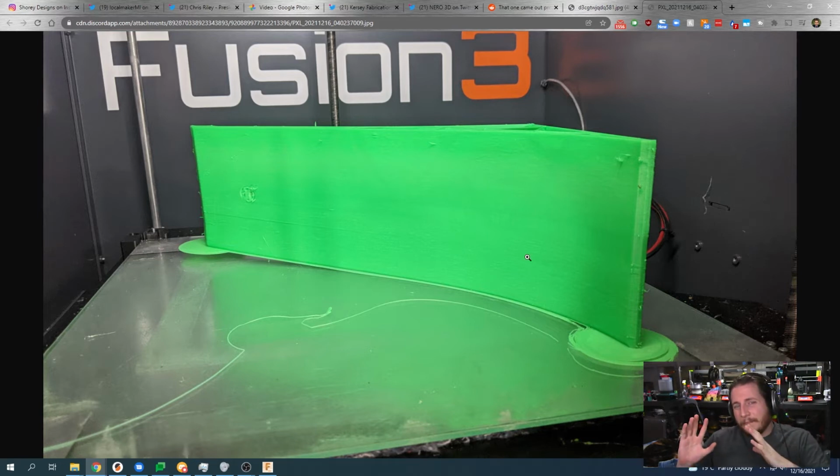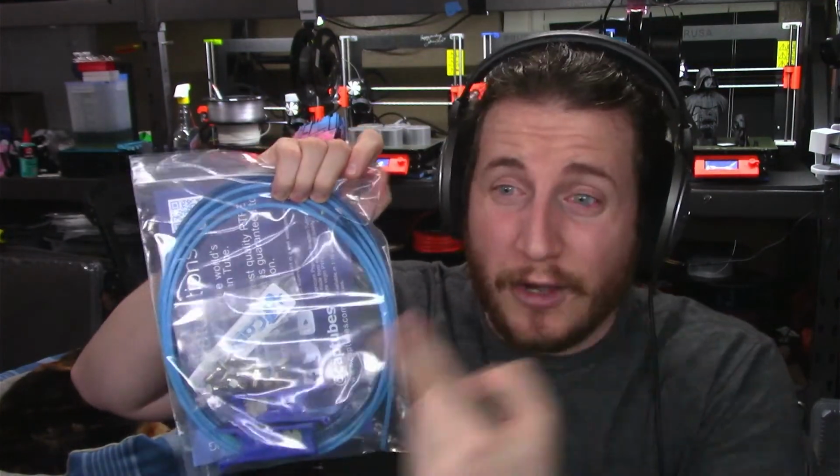But this printer does have like an 800 millimeter long Bowden tube. And part of our goal with all the Capricorn testing we're doing right now is to potentially switch this machine over to Capricorn and Cap Tube, which is pretty great. We're going to go through this in an upcoming video, so really excited for that. But to look at it, exchanging it and seeing if we can deal with the back pressure issue that we have. So this machine does have a fully enclosed chamber, and it does have a vented chamber.